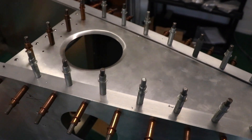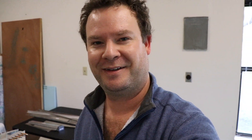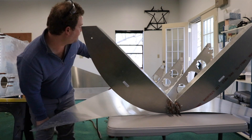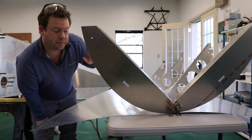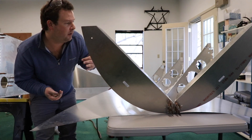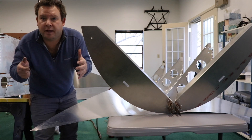It's looking pretty good. You have to get underneath the airplane and drill up, which is a little difficult. I've got a lot of aluminum all over my face and in my ears from drilling upside down on my back — it's a little exhausting but it's part of the job. I have the turtle deck upside down so I can work on it. I'm going to go rib by rib: take the rib off, dimple die the rib, dimple die the skin underneath, then go ahead and paint it. When all the ribs are complete on all sides, I can pull the skin up and around, Cleco it in and put it back on the airplane.